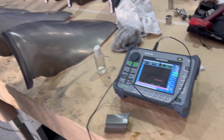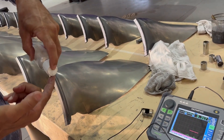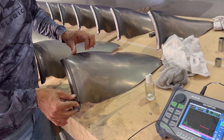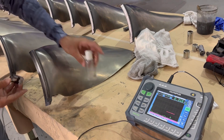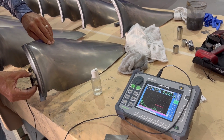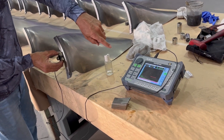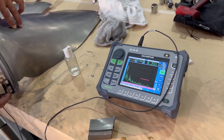All these blades — all 24 — we put liquid coupling on them, just like a medical doctor uses an ultrasound on a patient to check the condition. We put the couplant in between. As you can see, there are no cracks. I'm not going to bore you with all the details of doing all 24 blades, but this is the exam.